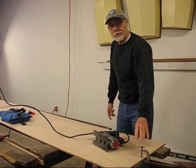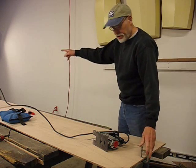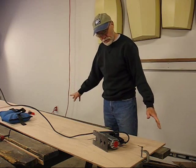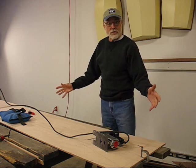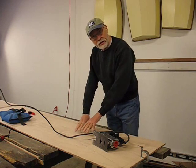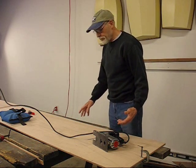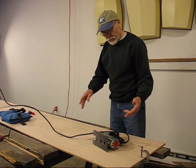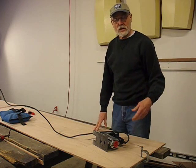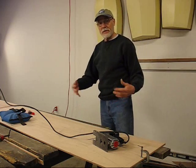Around the ends I've got two little C-clamps really tightened down, one on each end, and they're in areas where they're out of the way as far as wastage goes. Now that the panels have been matched up size-wise and lofting-wise, you want to maintain that relationship the whole time. Once I get a panel cut out, I'll keep it clamped up until I finish doing the edges so that you maintain that mirror image of each other.